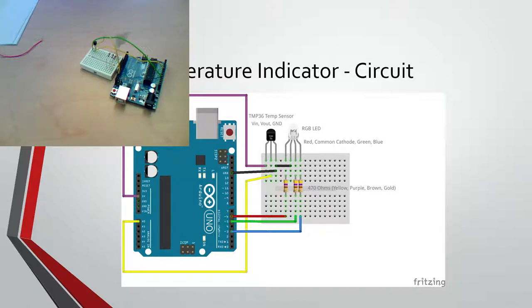So what this PWM signal does is it sends out a signal that goes like this, really fast. If this is the period of the PWM, it sends out a pulse that lasts for half of the whole period. Since it's going so fast, stuff like lights and motors mimic being at an analog voltage. So it's on for half the time, off for the second half, and the light will be dimmer depending on your analog voltage. It's not actually analog, but it's close enough.